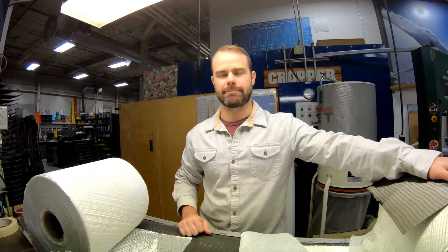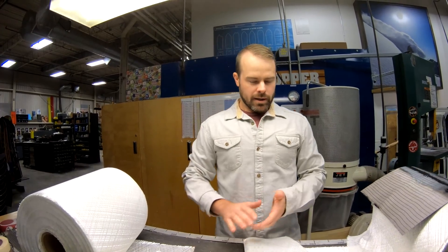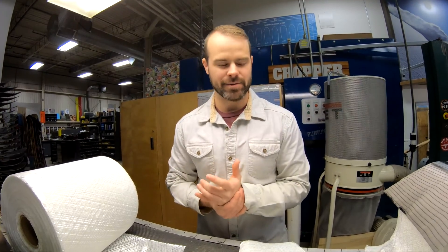Scott, fiberglass plays a big role in making snowboards react the way they do. Most boards either have biax or triax glass with some carbon or other overlays. What do those different glasses do to the reaction and feel of a snowboard? Absolutely. So your first designation is biax versus triax — that means two axes versus three axes. A biax glass has fibers running in the zero degree, tip to tail, and then in the 90 degrees, edge to edge. Biax boards provide a lot of torsional softness — a lot of foot steer, a lot of forgiveness, a lot of soft playfulness.